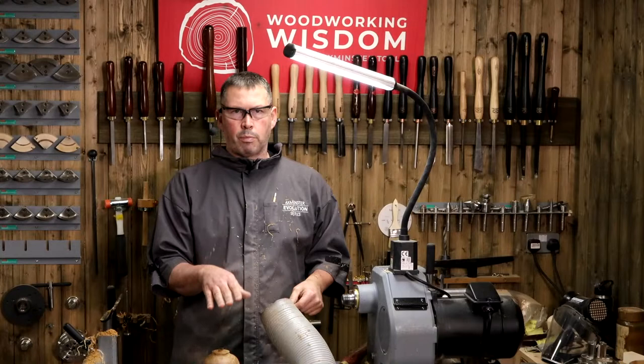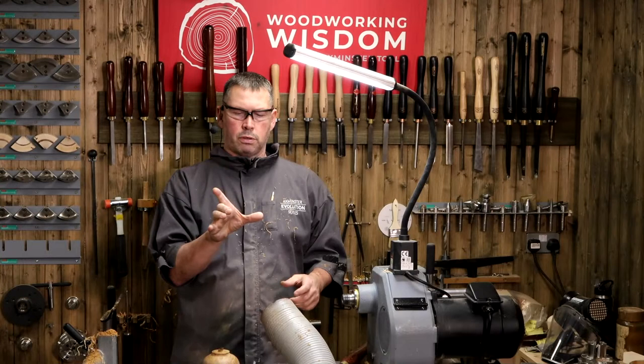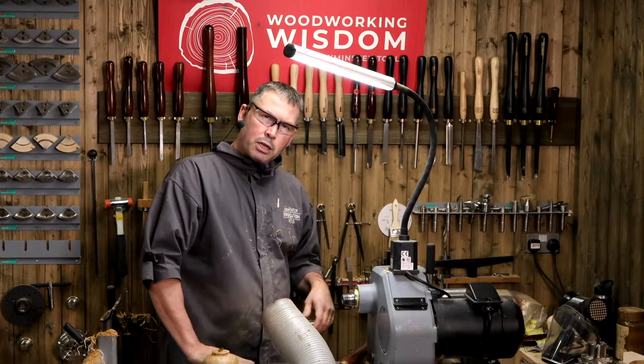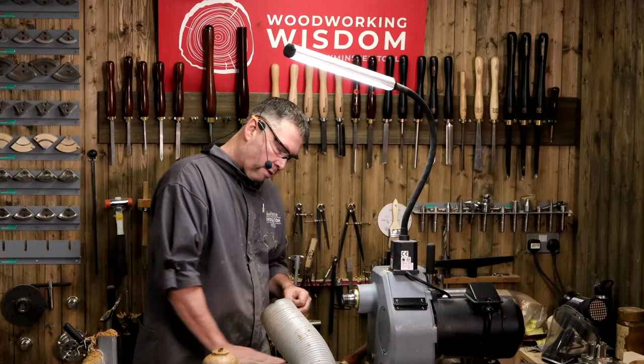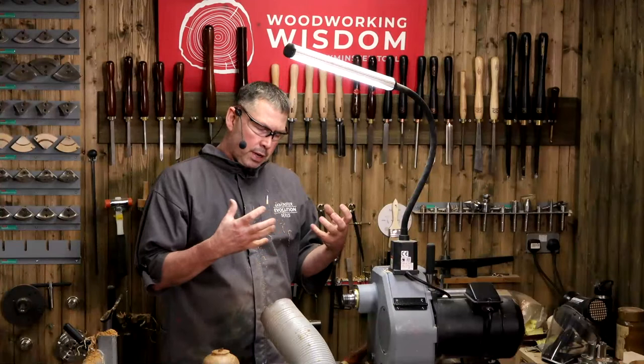Garryflex is the other thing. I've got little blocks of Garryflex, which I use with camellia oil. Spray the camellia oil and then use the Garryflex, especially the coarse one, which is a blue block. Which is a rubberized rust cleaner. That's the best way of describing it, really. It's an impregnated rubber block that you can then rub that off with. But if you embed it with some camellia oil at the same time, you're also putting good oil back into that metal. So a bit of both, Garryflex and camellia.